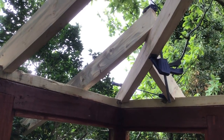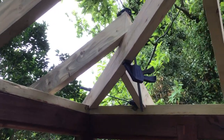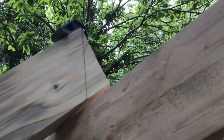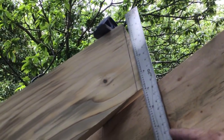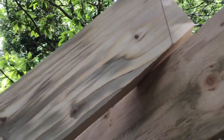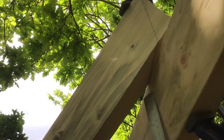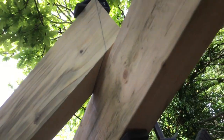I've placed the quadrant rafter just above the main corner rafter and what I've done is just use a rule against the corner rafter to draw that line, and then just scribed directly underneath it, as you can see just there, all the way down. So I'm going to cut that out with the multi-tool and that should slide into place.